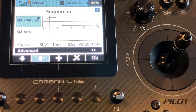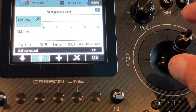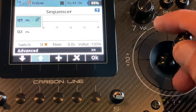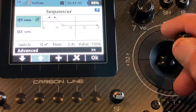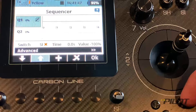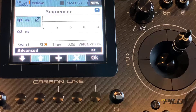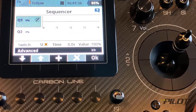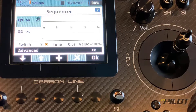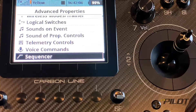Because I didn't set 'always finish,' I can stop the sequence mid-run, which is crucial during testing to prevent jam-ups. I once had the winch yank all the way up too far and had to decouple it to prevent damage — lesson learned. All you're doing is telling one or more servos what to do at different points in time. That is the sequencer.